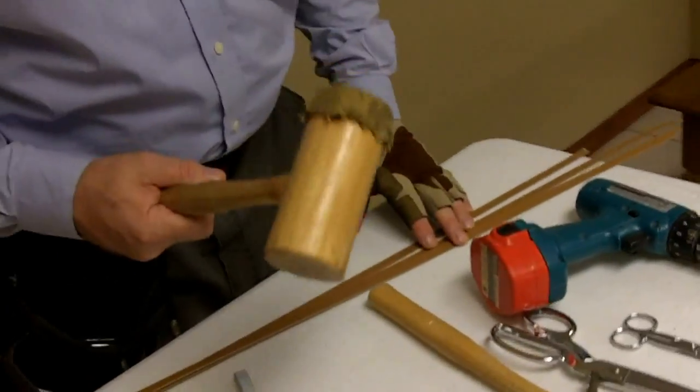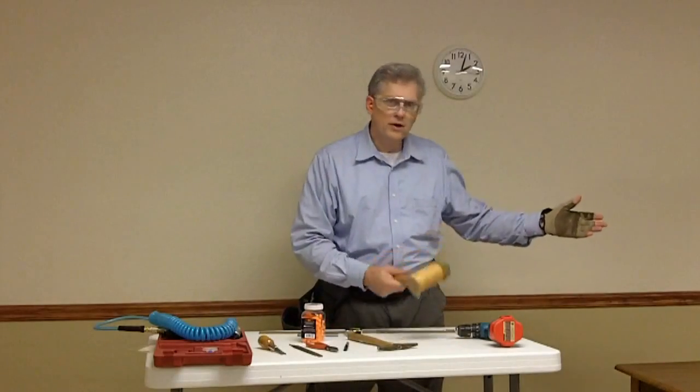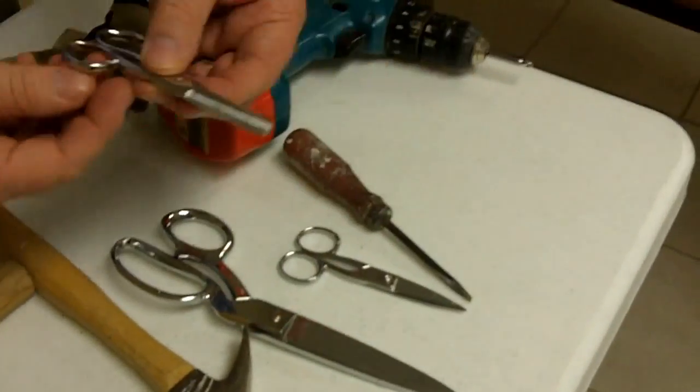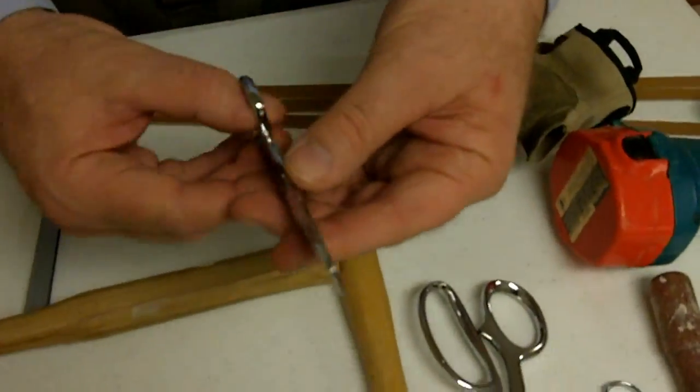A mallet is used to knock the chair apart. We'll be using about a 10-inch pair of shears on the cutting table — they also come in 13 inches. For those doing upholstery in the chairs, these are called tailor's points, which are essentially just the point of the scissors used for little close-in snips and cuts against the work. There are also pocket snips — the same thing but without the point — which can be carried in your pocket while working.